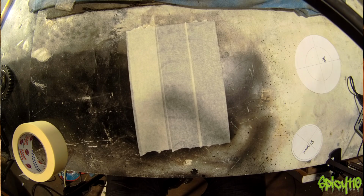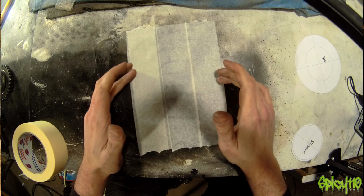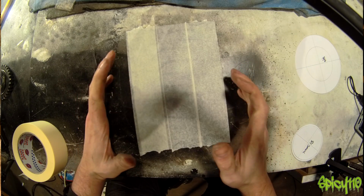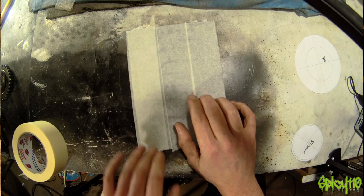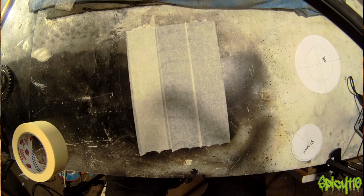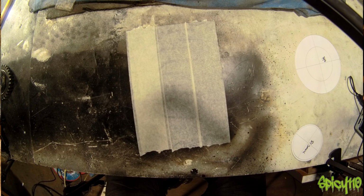One thing I will say is, if you use carbon fibre and you put tape on it like this, when you're done with your offcut, take the tape off and store it in a safe way. I know it's tempting to leave that tape on, but it'll harden and it will become a pain to get off, and you just don't want to do it. The low tack glue doesn't stay low tack forever.